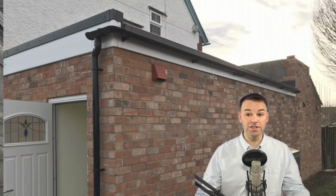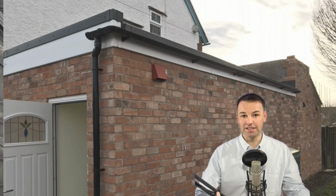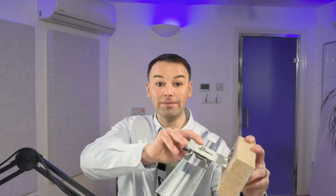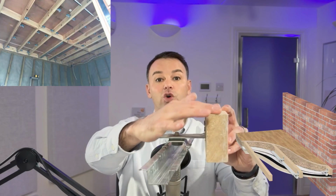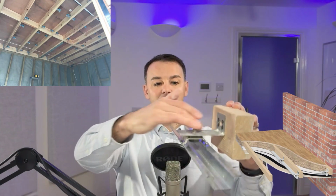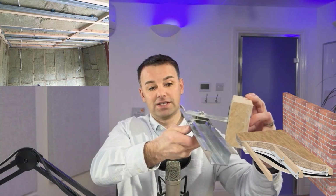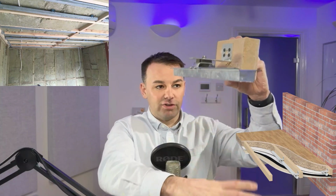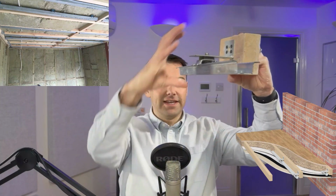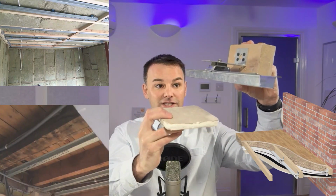There are different roofing systems, which I'm not going to go into in this video, but what I am going to show you is a space-saving clip and channel system, which you could install in between the rafters if you don't have much space available. Hopefully you can see that. Imagine this being the rafter or joist, the ceiling joist, and here we have a bracket holding the genie clip for this example. And this is the resilient channel, and if you imagine, this is the underside of the roof. So this is your drum room here, and this is your ceiling, this is your resilient channel, and this is one of your layers that you're going to install.